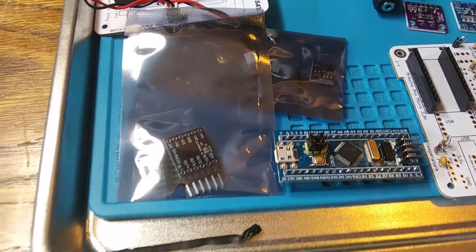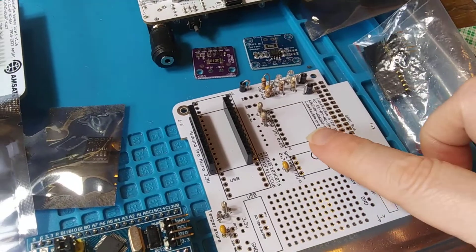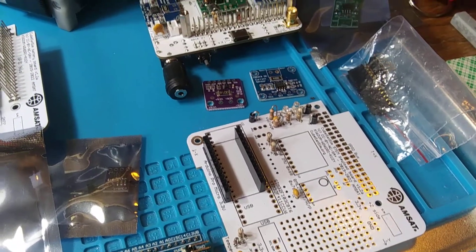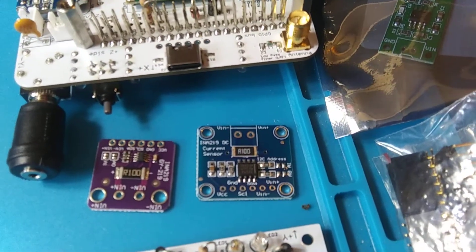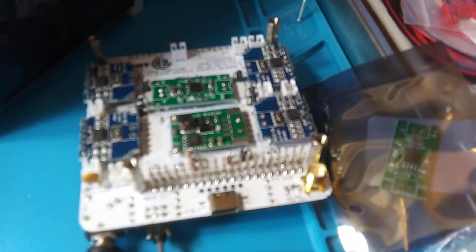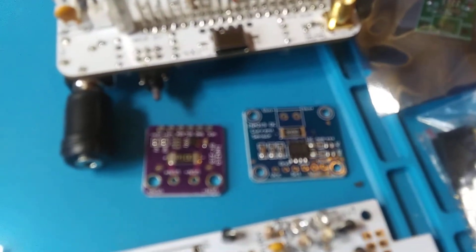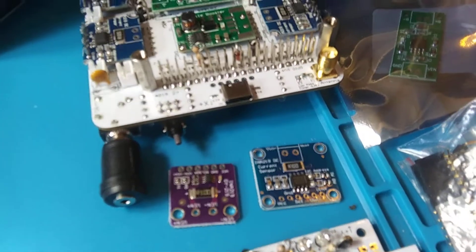In these smaller bags are spare sensors. The sensors would be soldered on right there. There's a gyro and an environment sensor. These are examples of two of the voltage current sensors that go on the main board. This board has the blue ones on it — my friend trimmed the edges off of them because they were too big. The purple sensors are more ideal for size but the blue ones have proved to be a little more reliable.